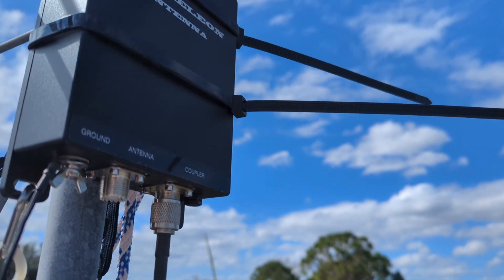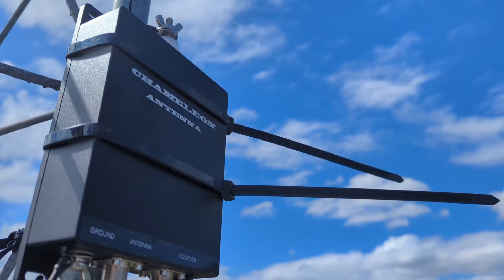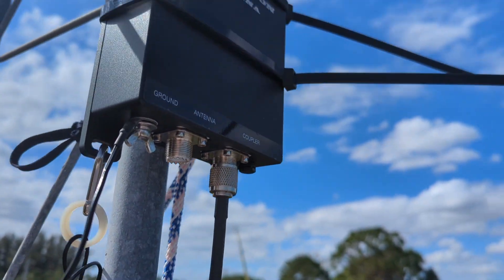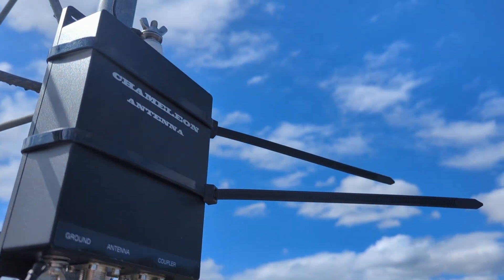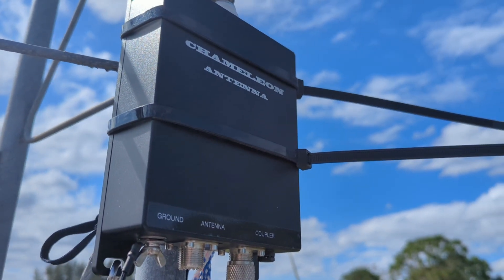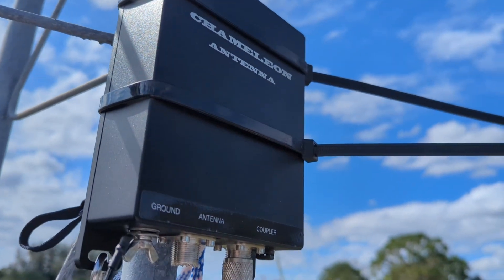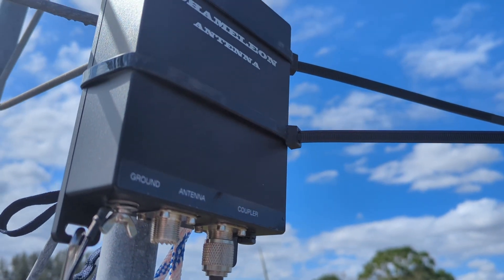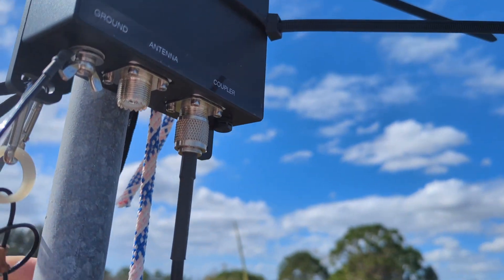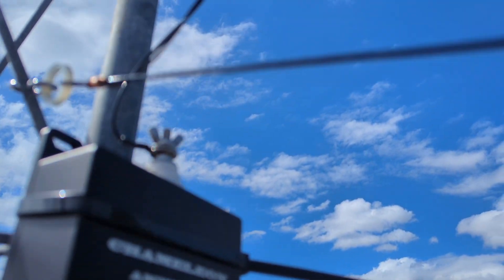It's like gangbusters on this thing right now. With the length of wire, there are certain lengths you want to avoid and certain lengths of counterpoise that are minimum — this counterpoise is a lot longer than minimum. I've had this Chameleon URT-1 for a while but haven't really used it. This is eventually going to be permanently mounted up here with heavy-duty 500-pound zip ties. If you're using the coaxial connection, you can't use the Beehive up top, and vice versa — you can only use one or the other.